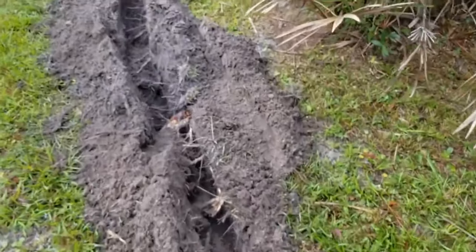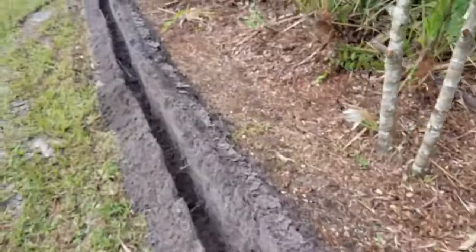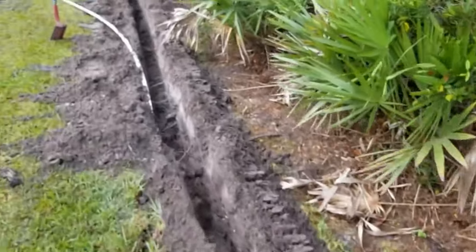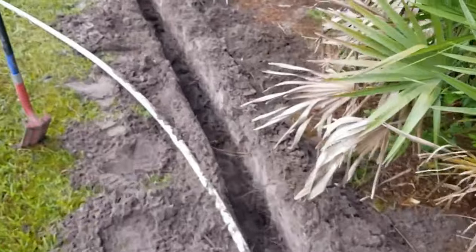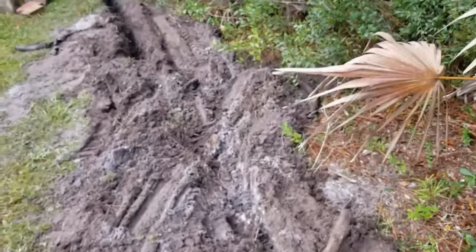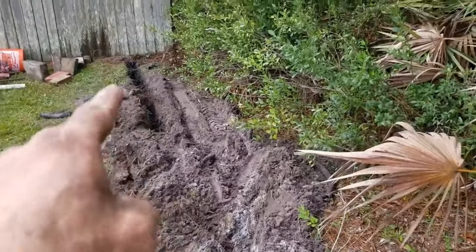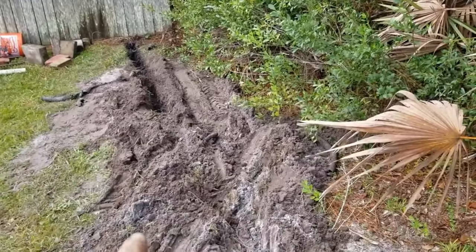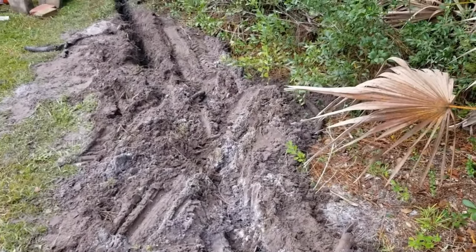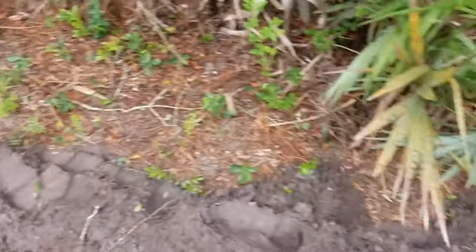You can see there's quite a bit of tree roots down here. I've got to take the trenching shovel, come back, clean all this out, and try to get as deep as I can because I'm actually walking downhill right now back towards the back of the property. I found the irrigation line and pulled that out of the way. Right here where you see all the excess soil, this is where I had to turn the trencher around. When you run your trencher and come up to a dead end at a fence, you're going to have to turn it around and come back the other direction — it's going to pull all the soil back onto your trench. So you've got to dig that out; it is real simple because it's already cut and roots are all busted out. Everything should come out of there pretty quick.